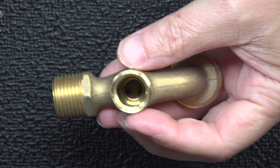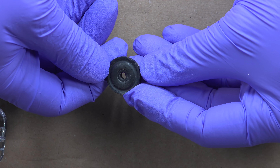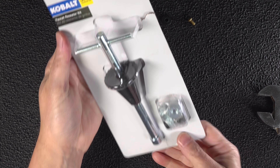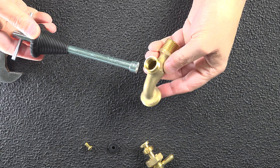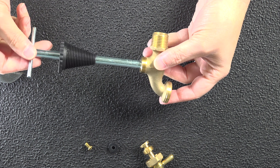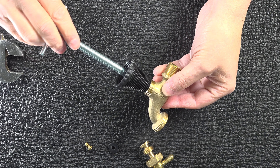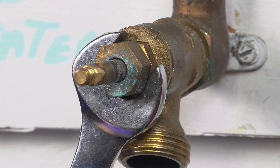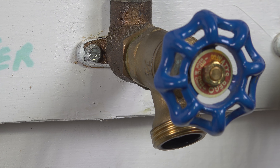The reason that rubber washer is so ingenious is because it is actually designed to be replaced — and that's the plumbing secret that most people won't tell you about. So if you just replace this simple part, you're going to fix the leak on almost all of your faucet situations. But if it doesn't work, there are other steps you can take, like a valve cutter or reseating tool that cleans up the base where the rubber washer sits. In my experience you generally don't need to do this, and if you do, you're probably going to want to just completely replace the faucet. I like just swapping out the rubber washer — it takes a few minutes, it's simple, and most of the time it's going to solve your leak once and for all. Hopefully this video gave you some useful information. If you liked it, please give me a thumbs up and subscribe to my channel for more videos.